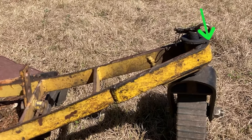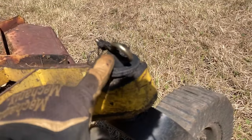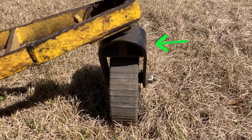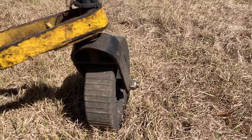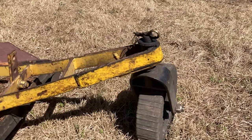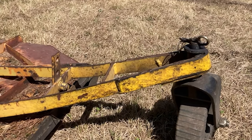When you're backing up over big brush you tend to get your tail wheel stuck. This knob that's sticking up tends to bend — the fork that comes down supporting the wheel will get bent. If you don't keep it greased, the bearing or shaft that the wheel rides on will wear on one side more than the other. This is probably the third, if not the fourth, tail wheel this brush hog has had, in addition to having this welded.